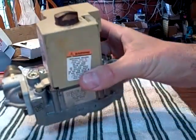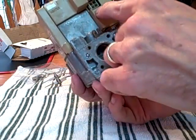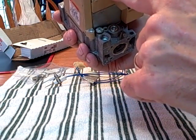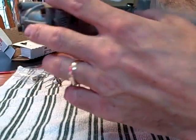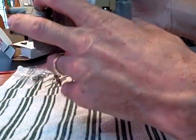Let's see if I can get the camera aimed in on it a little bit. This is just a Honeywell valve — there are other brands too, I think — but it's what they call a smart valve. It has a control tab here, four plugs, and the ignition plug set here, which has four pins. This one just has an on and off; some of them have a push button. It has a grounding tab, though some of the newer ones don't — they just expect you to put the ground wire on the furnace burner assembly.